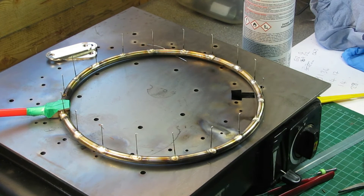They're not going to be all identical — we ain't got the equipment to make them all identical. Apart from that one that didn't want to play and melted the syringe, the rest of them I'm pretty happy with. They've all gone in nice. It looks tidy. I've had 60 psi — probably more like 80 or 90 psi of air pressure going through them. So they're not going to shift. They all get a slight tweak when they go in to the flame tube — just put a forward slant on them. Hopefully they're going to be good.